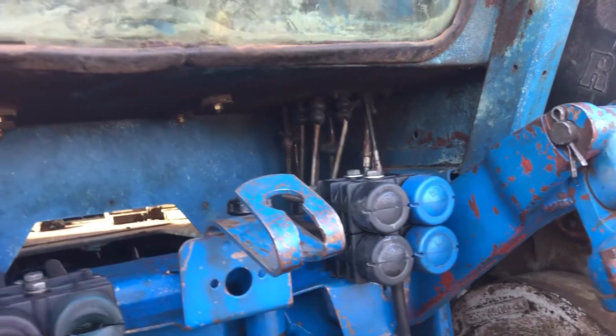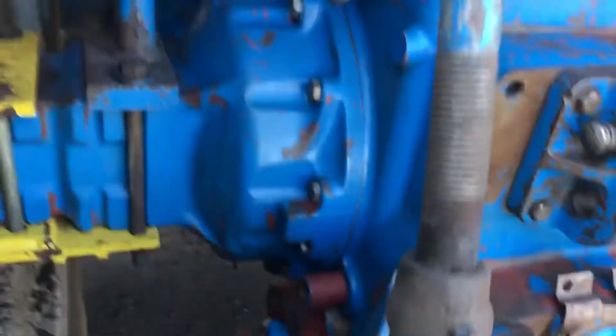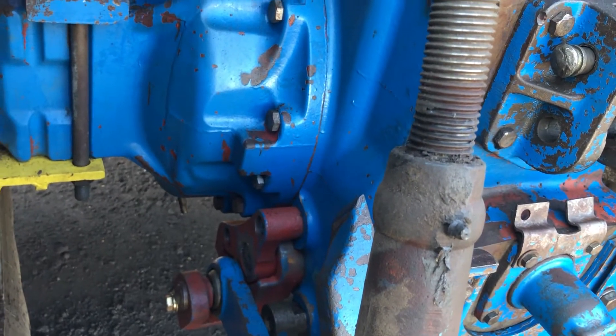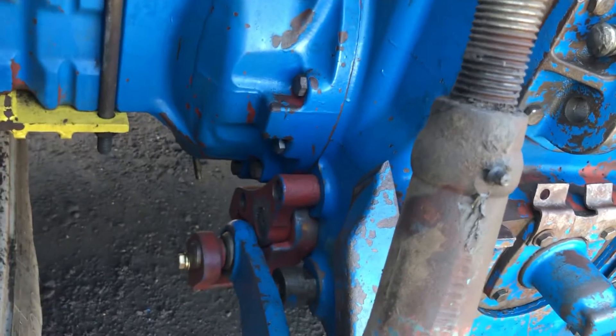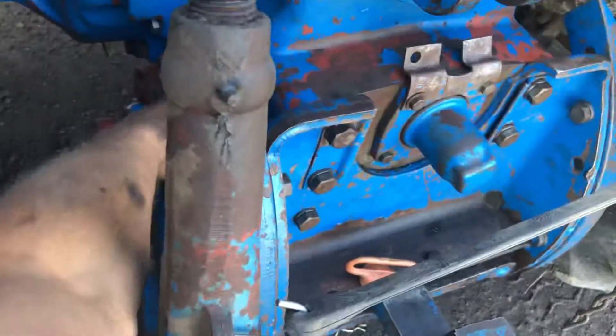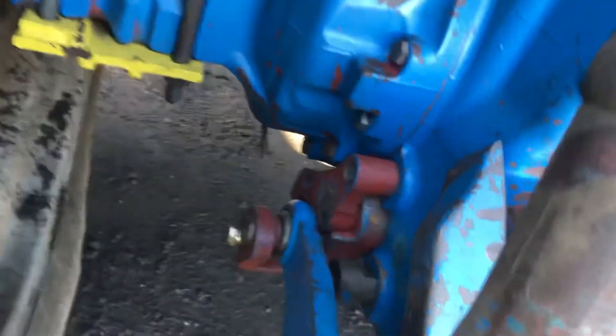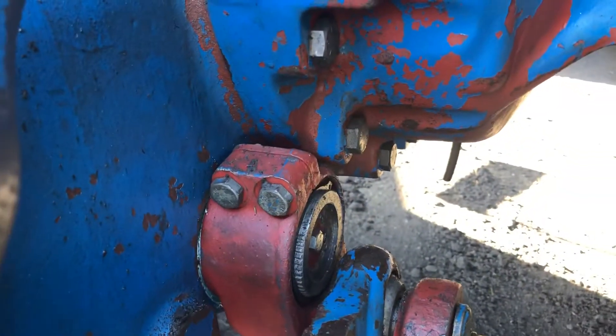Used parts aren't cheap - I bet we got a thousand dollars of used parts into this deal, including the stuff on this side which all has to be matched new. With the rock shaft you've got to upgrade your bolts - they used to be a half inch, now they're nine-sixteenths. And of course you want to get the new style clampable type to replace the old style, get some of the new wear washers and everything, put it back together, and that'll take care of your leaks.